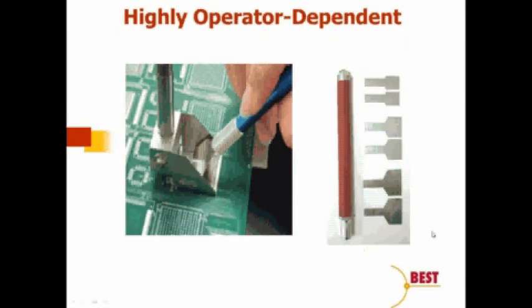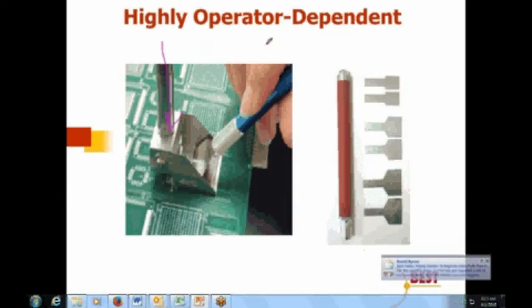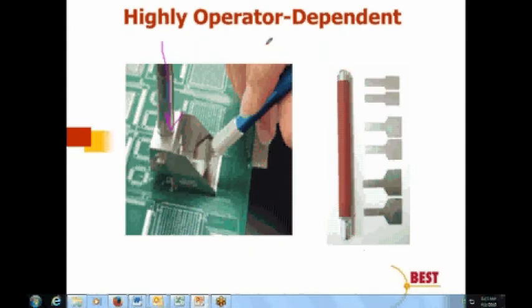Looking at the printing process — one of many configurations — we have a manual shaft holding the miniature stencil perpendicular to the board, providing downward pressure and keeping the stencil surface coplanar. That's one hand; the other hand is squeegeeing and rolling paste through the apertures. We need good solder paste: it has to be relaxed, brought up to the right temperature — not straight from the refrigerator — kneaded a bit, and have the right viscosity properties, as it's a thixotropic material, so we get a good bead rolling through those apertures.